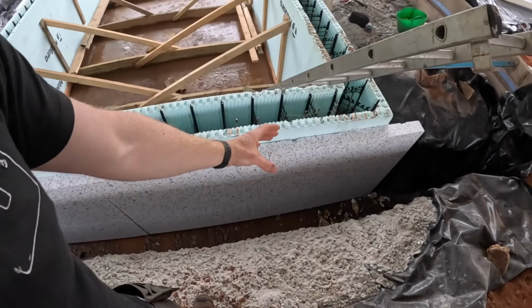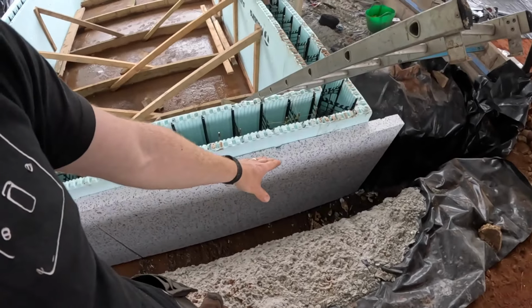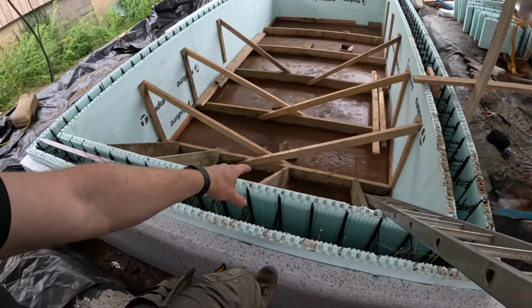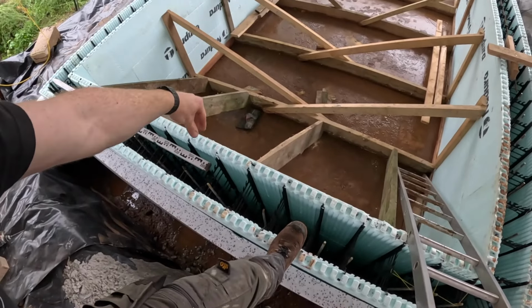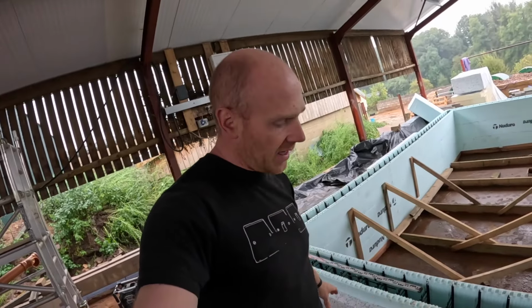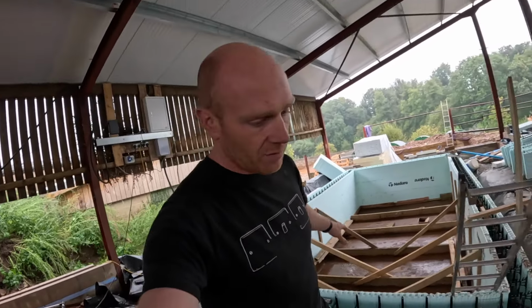And then that is our trench here. This is where we're gonna mass fill on Monday. We're just gonna come up about halfway, or not even that. We put loads of bracing, these huge 8-inch joists in there. And this wall isn't gonna go anywhere, especially down the bottom. The whole bottom is braced and bolted into the floor as well. Feeling confident that we can backfill and get ourselves a footing in here, and we can get this wall out of the ground prior to doing that ICF pour.